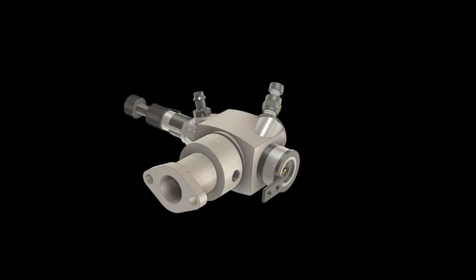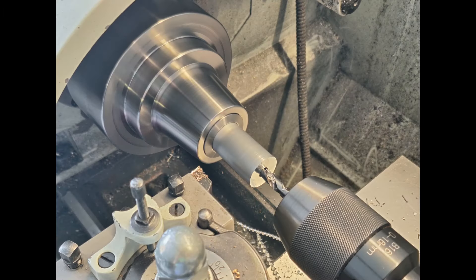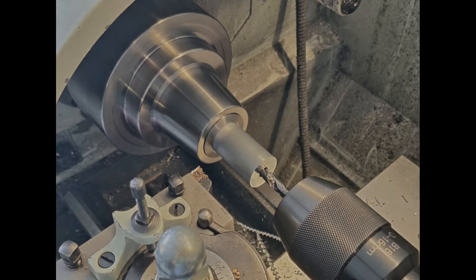So I fired up the CAD and designed a larger intake manifold. I used my tried and tested OS4C 8-millimeter carburetor — this is certainly large enough in cross-section. Then I started making the intake manifold. First, I turned the blank on my lathe, then I milled the contour.